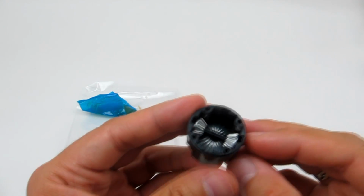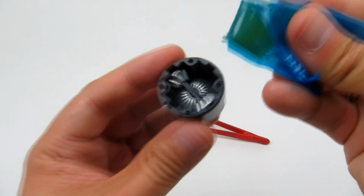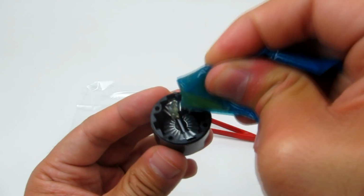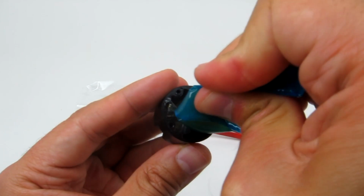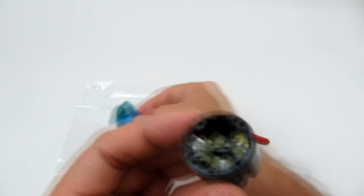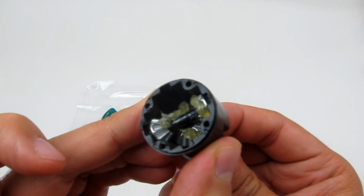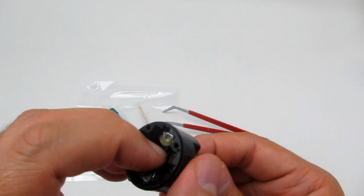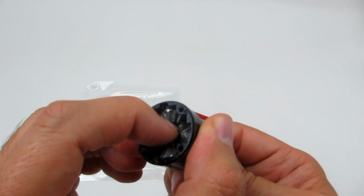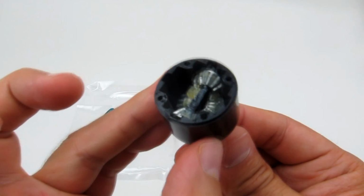And then we're going to put a good amount of grease across the shafts and the gears. Make sure we get a good amount everywhere. And that's step 5 completed. And so you can see if that shaft holds in place, you can see how the differential works. See all the gears turning inside. It's the magic of differentials. So we're just going to set this down, set it aside, and move on to step 6.